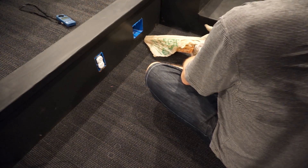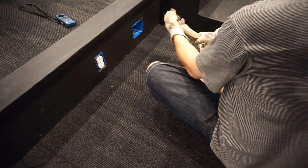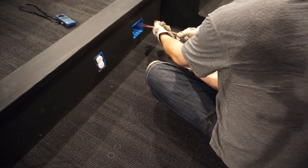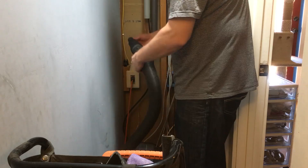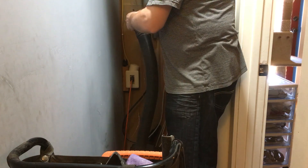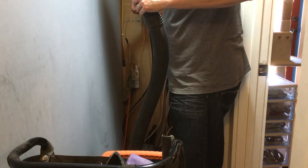Here's the actual pull through that conduit. And done. That's why you really want somebody helping out to turn the shop vac on and off. Even then, you'll almost surely get quite a bit of cord sucked into the vacuum.